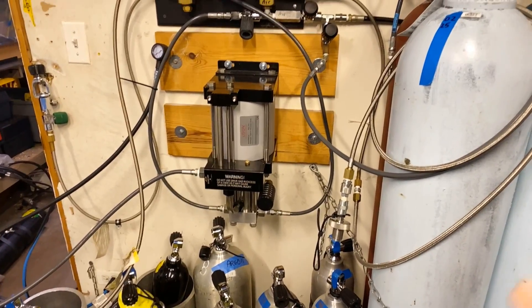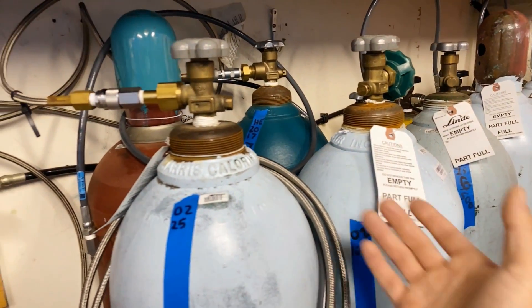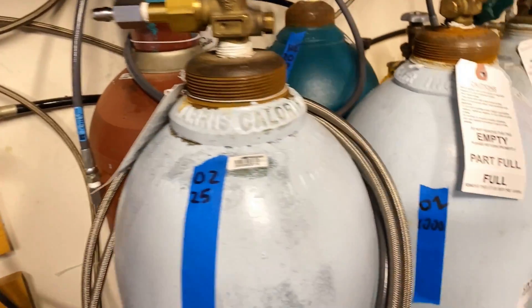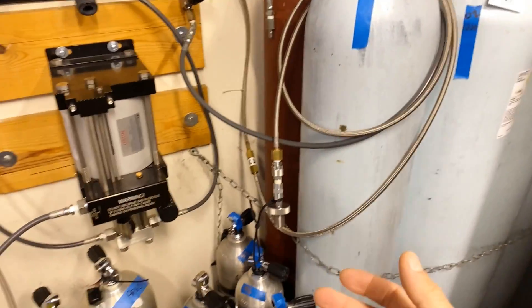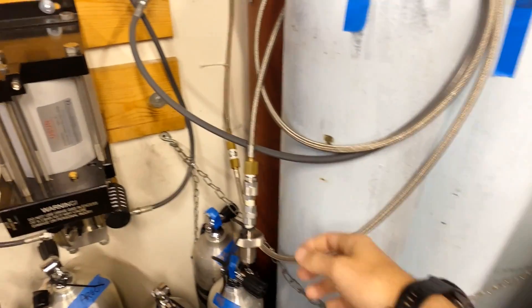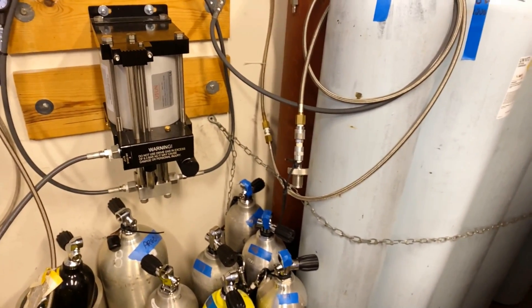You can go very high-tech or very low-tech with this setup. On our supply side, I wanted the ability to use different banks — I've got a low O2 bottle here and a high O2 bottle — so I can just grab our CGA fitting with a quick disconnect and switch between high and low. Another thing I wanted was the ability to scavenge trimix out of a spent bottle. I threw a DIN adapter on one of our whips so I can take a set of doubles and boost it into another cylinder so I'm not wasting it.